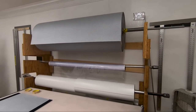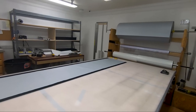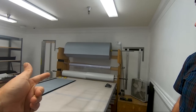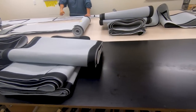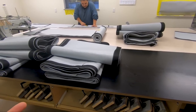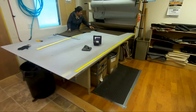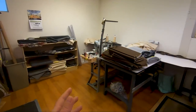This is how the whole outer pop-up shell basically starts — that's a thermal pack. The vinyl gets cut here, the thermal pack gets cut here, the windows get cut here — everything comes off these rolls. Then everything gets put together: Velcro is applied, the two pieces get mated together, and this is the thermal insulation. Once it gets sewn up, they hang it up right here. All those materials and options we saw get cut here and put onto the foam. Then it's brought down to the staging area.